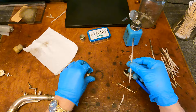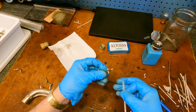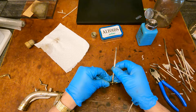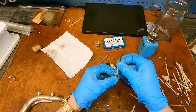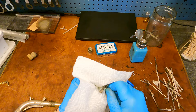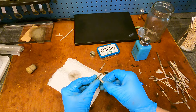After doing this job, there's a lot of naphtha evaporating into the air, captured by pipe cleaners and paper towels — so I'm going to take out my trash after this. I've got windows open right now, but you'd definitely want to do this somewhere well ventilated. You'll get used to the smell, and it can be shockingly strong when you leave and come back. It's not the kind of thing that causes immediate major illness, but long-term exposure is not good — so wear gloves, keep it ventilated, and throw out your trash; get it outside of interior spaces because it will just continue to slowly evaporate off the pipe cleaners.